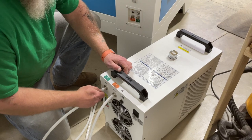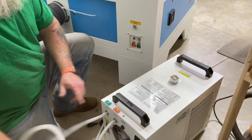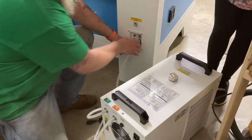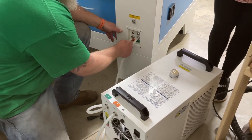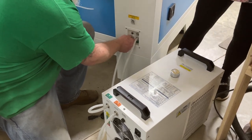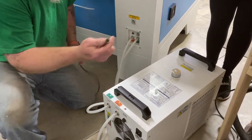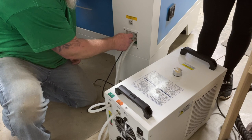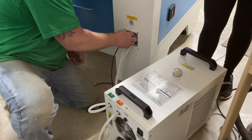You just slip these on the pieces. I'm on green — green goes to green, because that says water in and this says water out. The other ones don't do the color coding, and the color coding makes life so much easier. Those two are in place. Your chiller alarm — you can figure out which way it goes, it just slips right in and then you tighten the nut up. It really only goes one way; you have large pins on one side and small pins on the other.